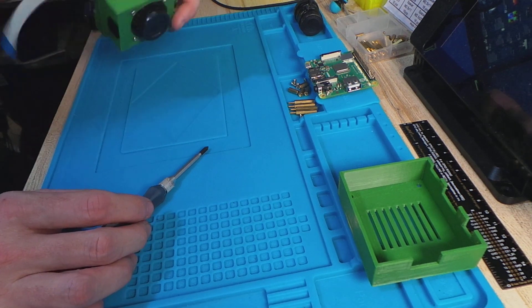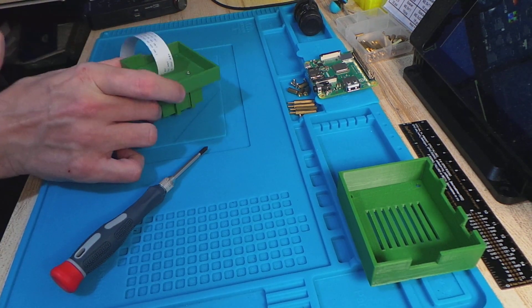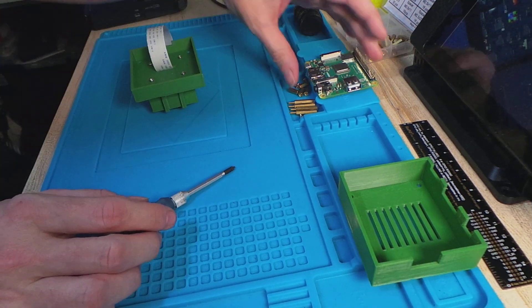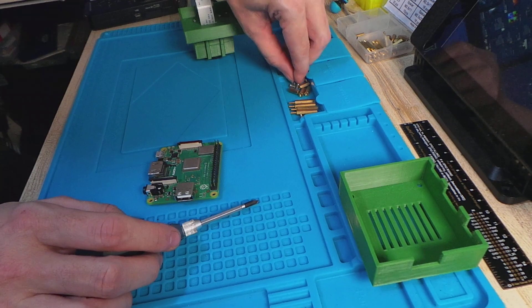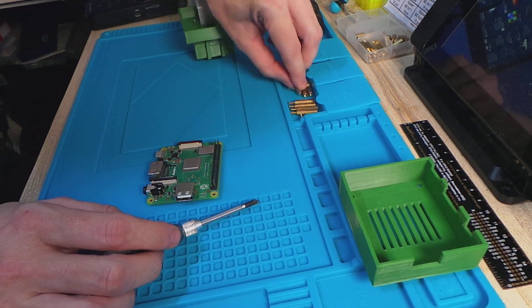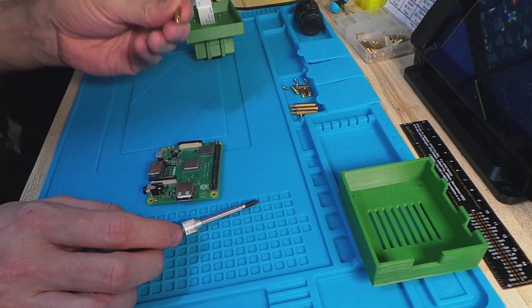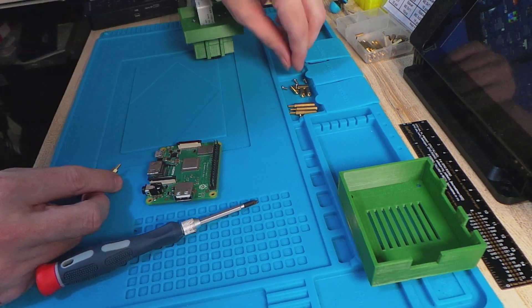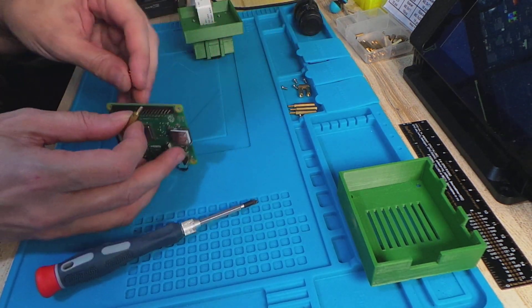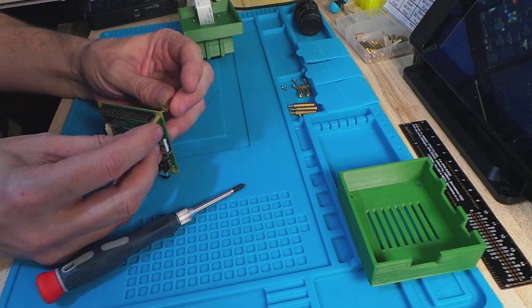Again, you don't want to over-tighten that. So there's our body. Now for the Pi, again there's eight of these screws, four of these spacers, but then it's four 2.5x20 plus 6 spacers — these are slightly longer. Attach these to the Pi: the small end to the base of the Pi, long ones to the top.